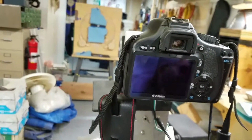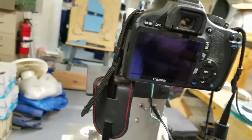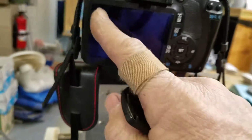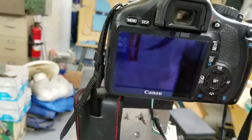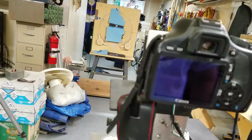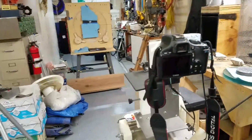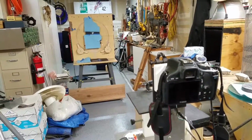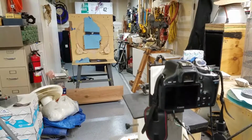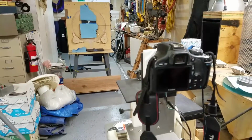Now that you got a test exposure and you got it all situated the way you want to do it, you'll dial the thing up to a 30-second exposure. Okay, for me, it's a 30-second exposure at ASA 400 with those holes down there. Gives me a histogram that comes out to about 75% over here, which is what we're after. And that is it. It's really remarkable. It's that fast. It's, to me, quicker than Foucault testing. It's more reliable. It's more repeatable. It's as reliable as a caustic test, only the caustic test takes you like 3 hours to do right. And we're going to go in. We're going to run the data now.